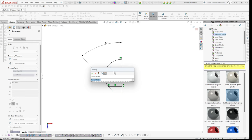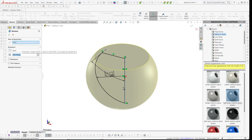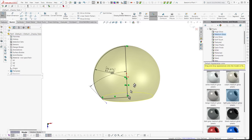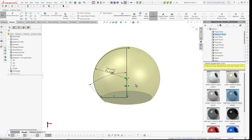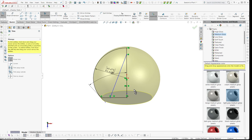I'm going to grab my ruler from DigiKey — they sent me a free ruler with all kinds of data, hole sizes, things like that. If I open my hand up, it measures about five and a quarter inches. So 5.25 divided by two for the radius. I'll click that, type V for revolve, and there we go. But wait — for 3D printing I don't need all of this, and I also want it to be fairly easy to crush. So I want to do something like this: instead of a hollow that would create overhang up top, I'll do a conical shape.